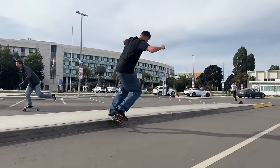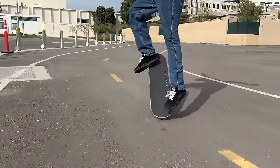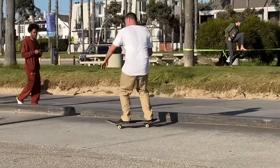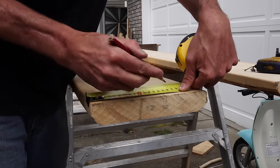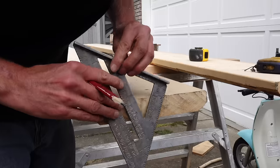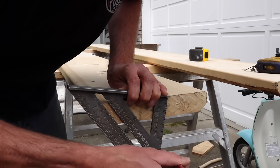If you chose a three-quarter inch radius you'd be able to get a really good lock-in on your grinds. However, if you're building this curb for aesthetics you might want to go with something more like a one to two inch radius. There is a ton of options when it comes to radiuses and curb profiles, so you should choose one and let that dictate the shape of your form. I knew I wanted my curb five and a half inches tall, so I marked it right there, and then I took my speed square and gave it a 10-degree angle.